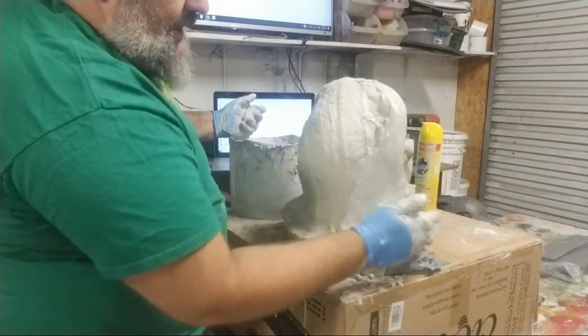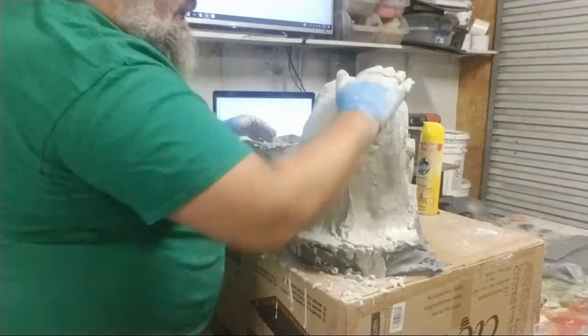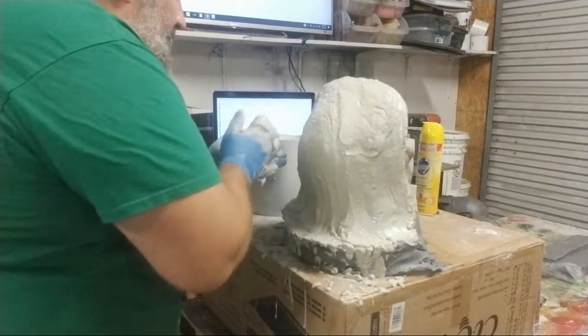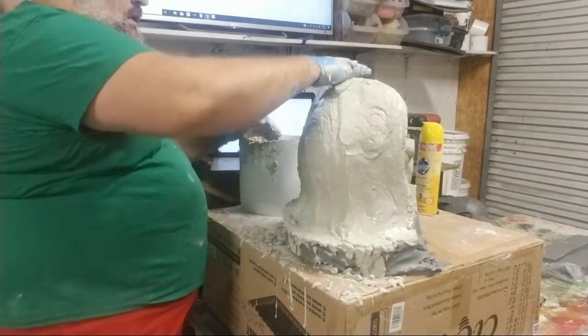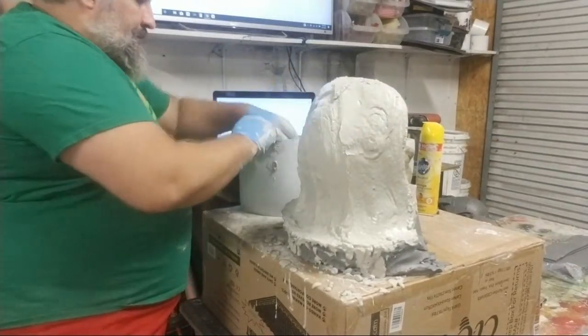This mold is going to get a lot of strength from its circular shape. It's very rounded, as you can see. And I'm reinforcing that as I put plaster on. I'm making sure that it stays nice and rounded. I'm doing these nice thick corners. You know, my mold doesn't swoop in. It's going to come out a little bit.